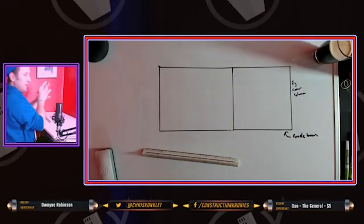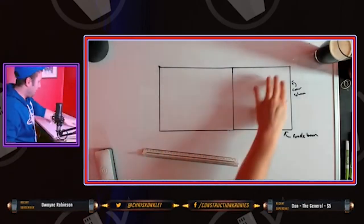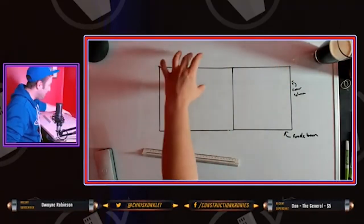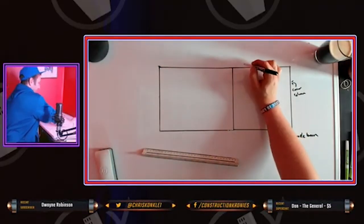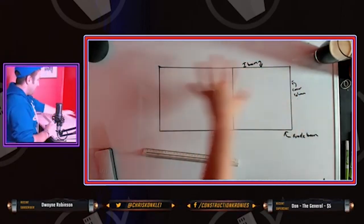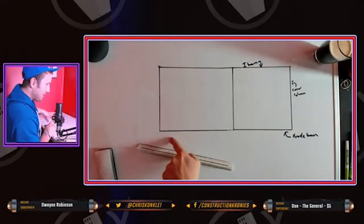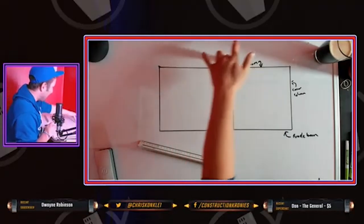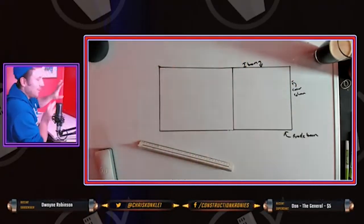There'll be iron and then Q deck on top of it. So you'll have beams going across from column to column, and on top of the beams, there'll be Q deck. This is just an I-beam, we'll say. Column, concrete grade beam at the bottom here, and then this is an I-beam for the roof, with Q deck for that roof on top of that I-beam. And then there'll be trusses and stuff like that on the inside of the building.